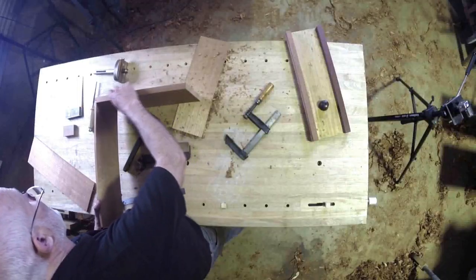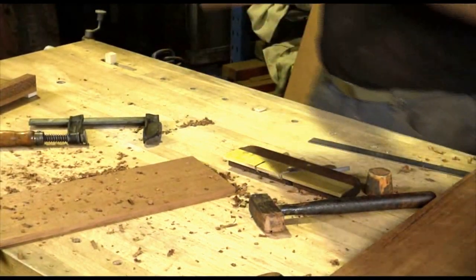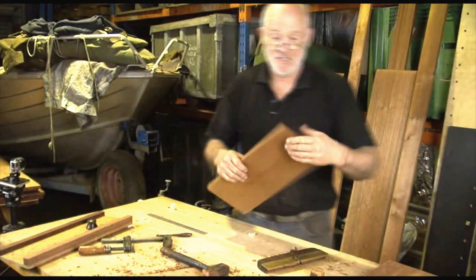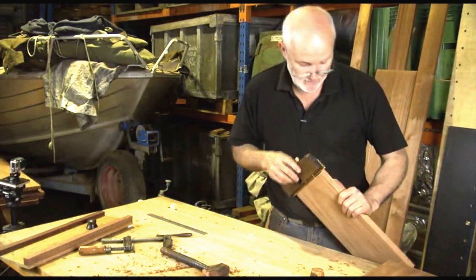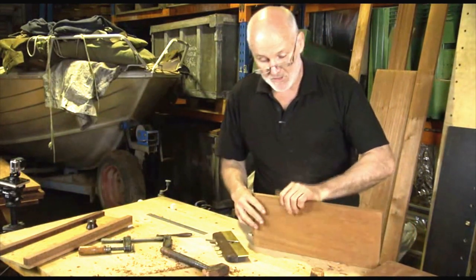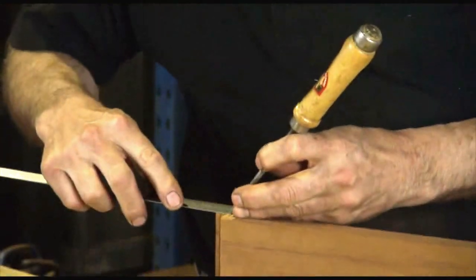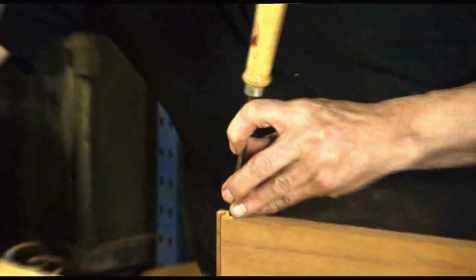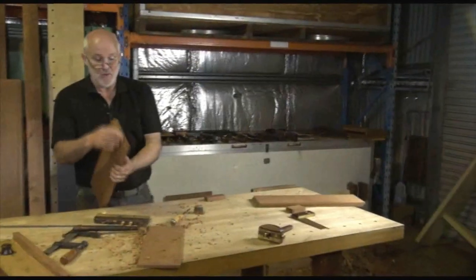See what's starting to happen here. We will now cut a little dado down in here. Just checking that I've got my rebate half an inch deep both ends, so it's nice and parallel because that's important. When I'm planing in the vise, I'll be using that part of the plane. I've just marked with a chisel three sixteenths of an inch — sorry, five millimetres deep — and that will stop the wood breaking out. Now my rebate's right.